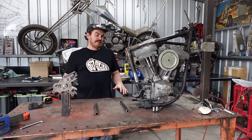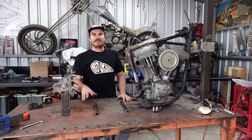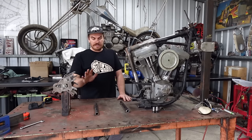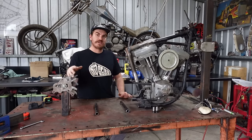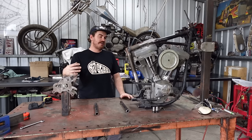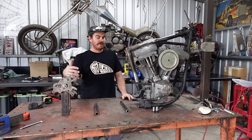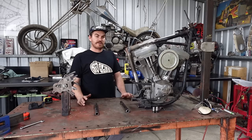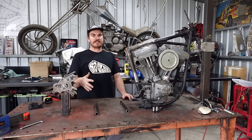So next we want to start measuring up and bending some tubes. I reckon we'll start with the bottom legs first — they're the easiest. The top section is a little more difficult because you've got a mitre cut and two bends to compound, but we'll get to that. There's a few ways to work out where to bend, and there's even apps you can use, but I do it a pretty simple way because I find it's easiest to keep things simple. Before we get to where bends start and stop, I'm going to show you the bending rig I use.